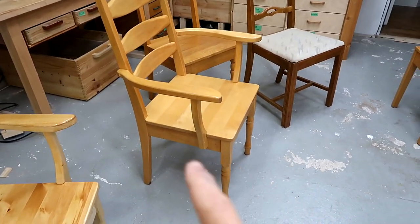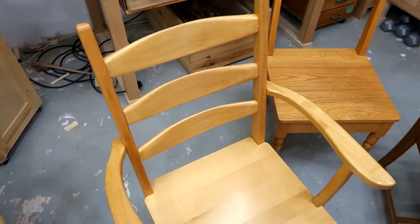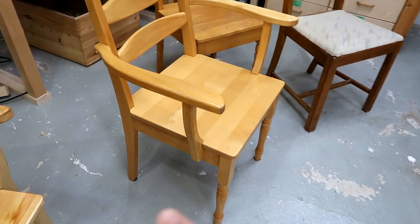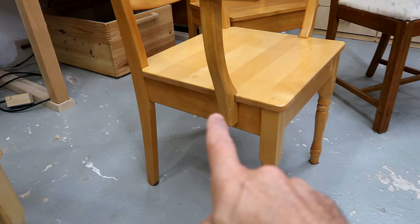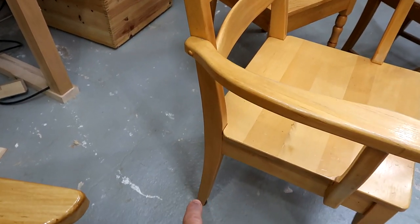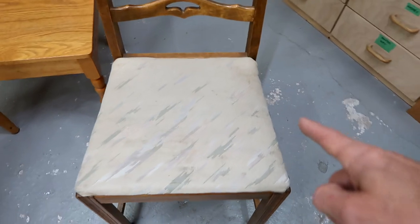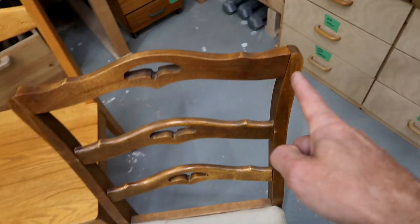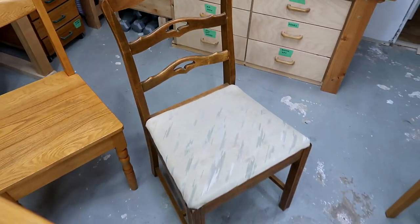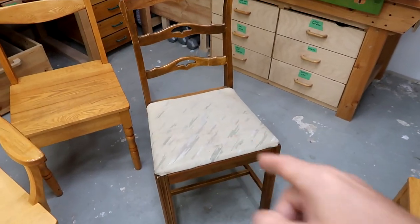I studied absolutely every angle of this chair when I came up with a CAD model for it, and I've really gotten to appreciate the beauty of this design. It's also a very simple design because there's not a single miter in this chair — all the mortise and tenon joints are square. The back is at a bit of an angle, but that's not actually a miter joint, it's just that the piece is cut at an angle, whereas most dining chairs have a seat that's a trapezoid, and often the back rungs are angled in the opposite direction, which makes for pretty complicated joinery.